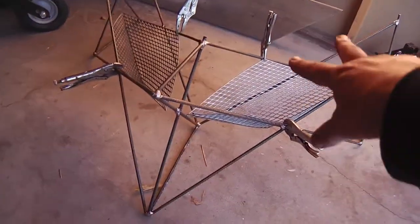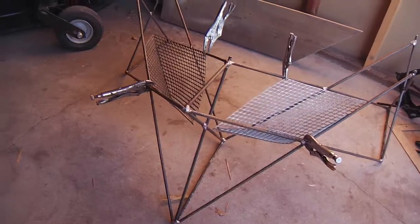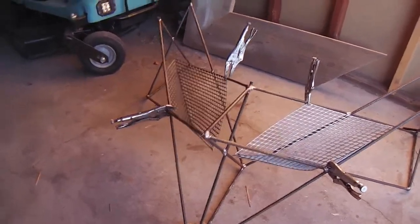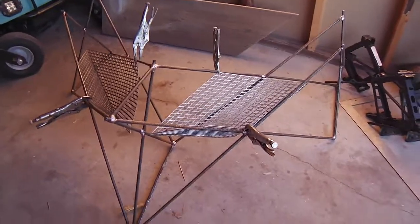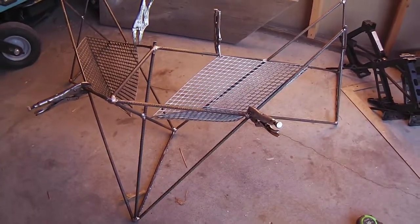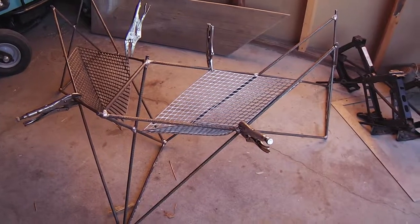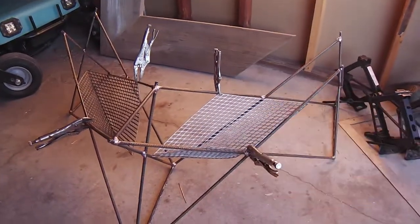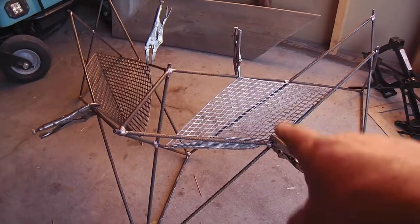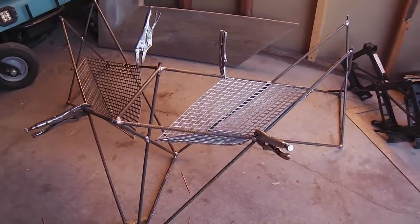This is what I'm going for — I'm going to put a bolt facing the outward direction. I think that's the more typical way this bench is going to be placed, on a corner rather than in a corner. Even if it's turned the other way, you can still get into those little baskets from the other side — it looks more symmetrical this way. I'm going to tack them in much the same way as I did on the straight bench, with just one little bead right in the throat of that thing and up there at the top too. That way if you really want to make a minor alteration, it'll be easy — just break that free and turn it around.